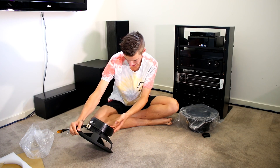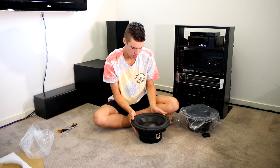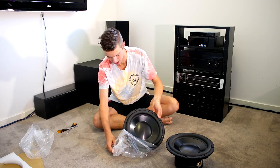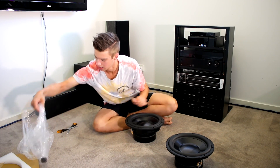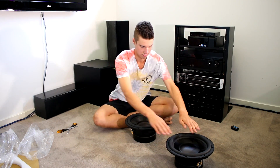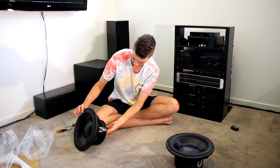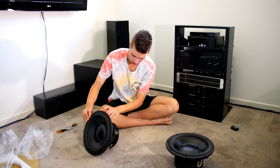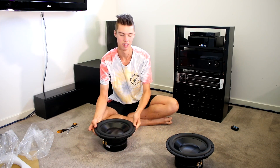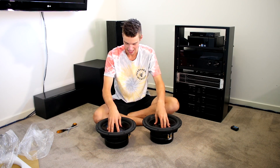I'm just checking for any shipping damage at the moment. This is the first thing you should do when you get a new sub — just check it over. Make sure there's no visible damage and then test it out. This one here is the one that wasn't packaged great, so I'll quickly give it a check over. Nice and stiff. Doesn't feel like there's any coil rub, so the magnets aren't off-center. Looks to be no damage on this one. Judging by the build, I don't think you'd be able to break these very easily at all. Here are the two new HO 12-inch subs — they look nice and they are so stiff.